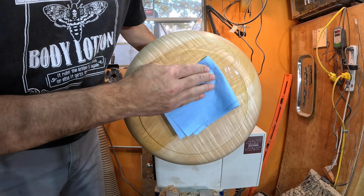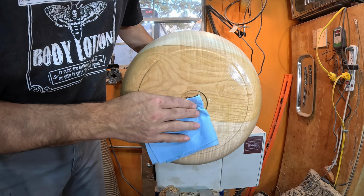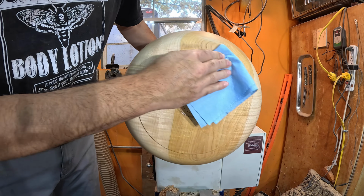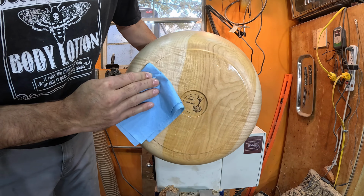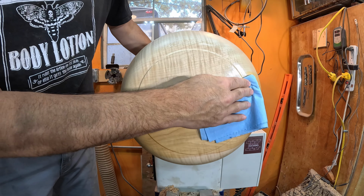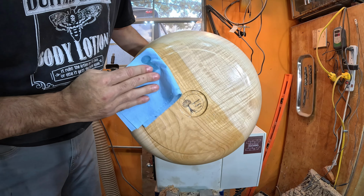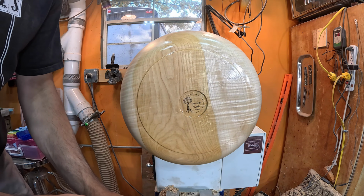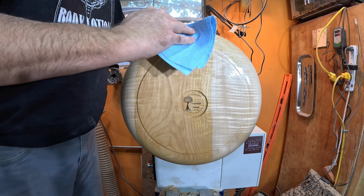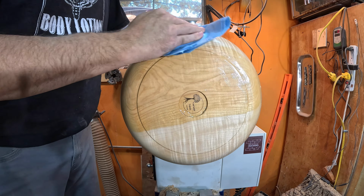on the lathe, and get that wax to just melt in with a little bit of the heat from the friction that's used with the lathe. I usually start out around 300 to 400 normally on pieces, and then I'll kick it up higher. With this one, I don't know that I'll have to go much above 600 RPM, because that's where I started out with the abrasive paste and was getting decent heat for that to get hot. So that should be fast enough to melt it in on this piece because of the size.